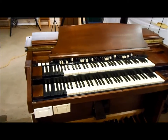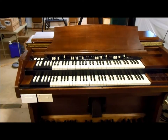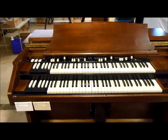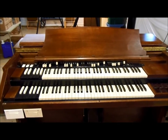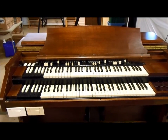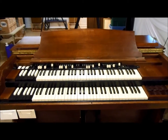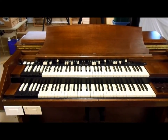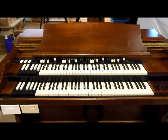This console is a 1951 Hammond RT2. In terms of getting it working, most everything is now working. When I first got it, the tone wheel generator wouldn't even start. After a lot of troubleshooting I figured out the run motor was bad. After replacing the run motor and doing lubrication, the tone wheels finally stopped squealing. It's running very smooth and quiet now, and all the tone wheels are working.